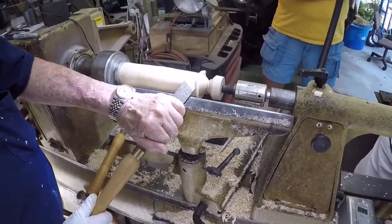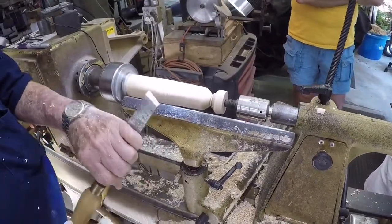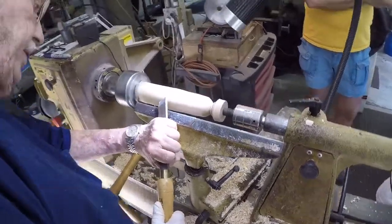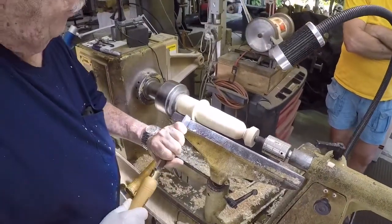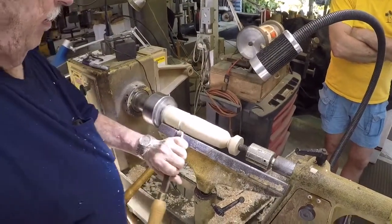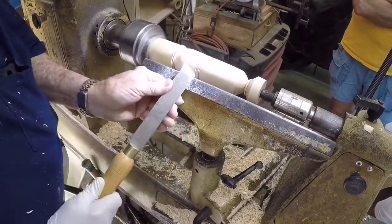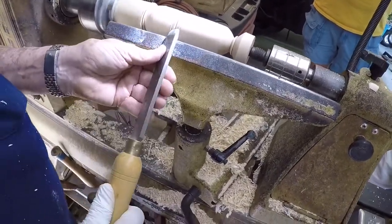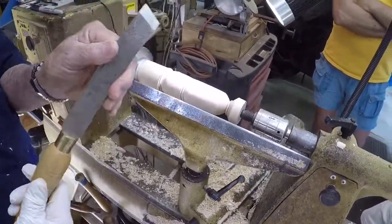I'm always shooting to get that planing action, because you're doing a cut versus a scrape. If you're going that way I can easily see where it's cutting, but if I bring it over here I'm down here looking where it's cutting. Turn it over — look at that. You push in and start in the middle of it, go over, start in the middle again and go over. You don't care which tip you're using. It's all about posture and what you can control.